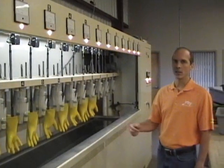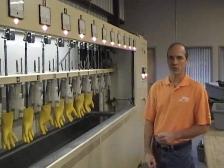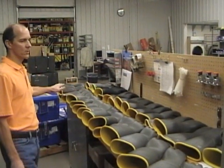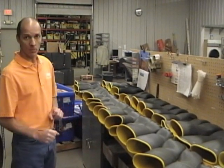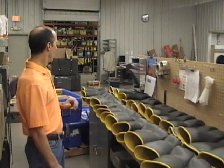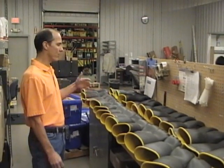At that point, we remove that glove from testing, replace it with a new one, and retest the entire batch to make sure they all pass. After testing, the gloves are dried, after which they're prepared for shipment. We lay them out on the table to pair them up — lefts and rights, same size, same numbers, if that is what the particular customer wants. We stamp each glove that passed with a certification stamp indicating that it did pass and the date that it passed here at Irby Test Lab. We bag them, seal them for some customers, box them up, and ship them back to the customer the same way that they shipped them in.